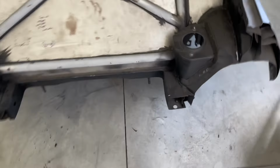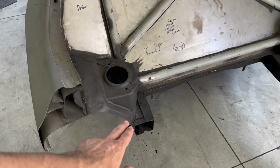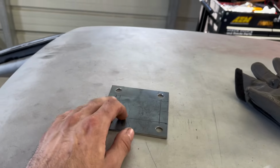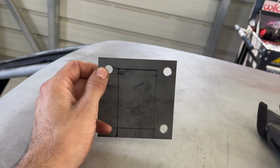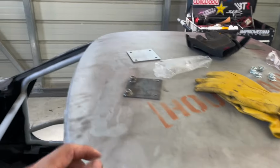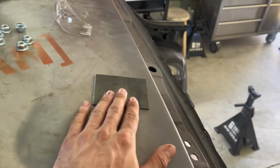All right, it is the next morning, so I'm gonna go ahead and cut this thing back a little bit more, and then we'll put these plates on here. And I don't know if I'm gonna start that part of it yet, the tube work, or if I'm just gonna flip this thing back around. Well, actually what I have to do is I need to make these other plates. So I'm gonna trace these out onto my 1/8" plate that was left over. So I'll cut those out, drill the holes. That way, when I weld these on, I have the plate to sandwich it to and build my bash bar off of. So we might end up making those plates, just basically working in the front, making the plates for these two. But definitely would like to cut that off, weld these on, and then decide where from there.